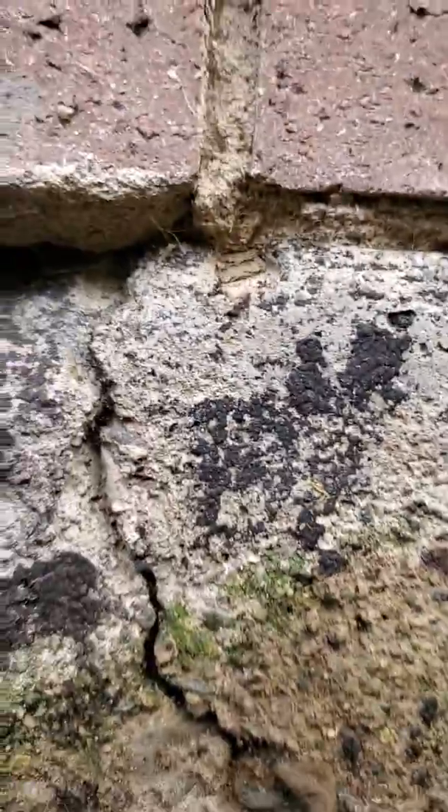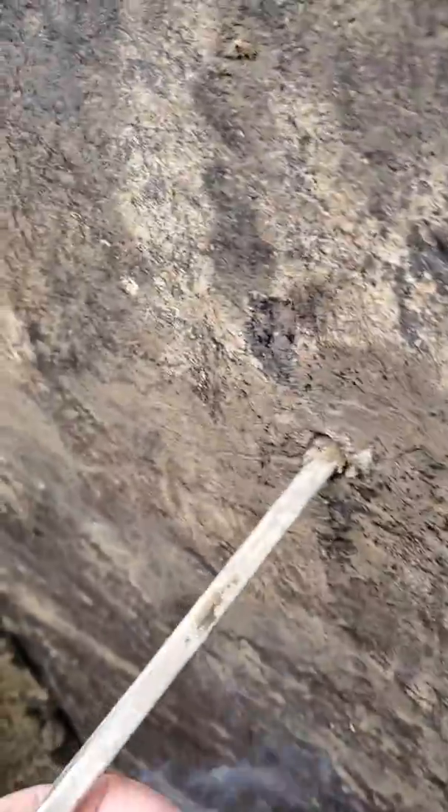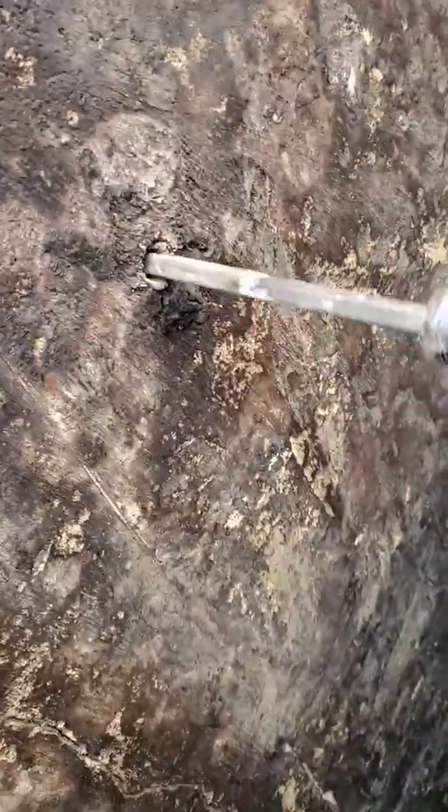Anyway, to the wall — here's how water is getting in. See the scraper and the crack? Cracking in a poured wall, then you've got these gaps where the first course of bricks sits on the wall, and rod holes. The upper ones, as you can see, are wide open. It's through any and all of those that you get water intrusion.